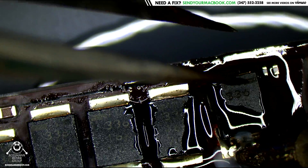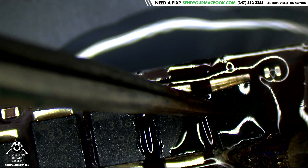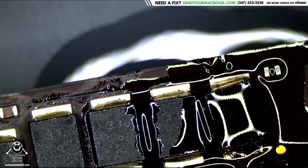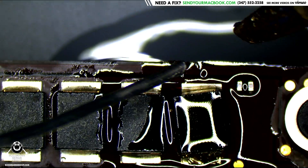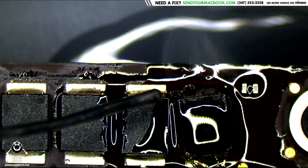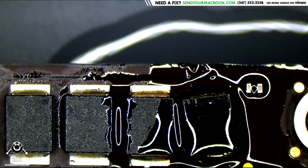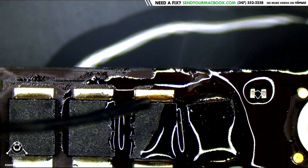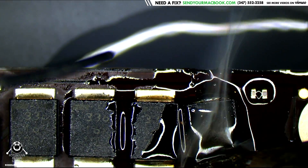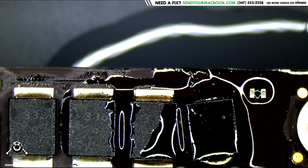Like Paul Wall would say — sitting sideways. And now we solder on the top. This side is going to be closer to flat against the board. This is how you could do it if you don't have a hot air station — something someone asked in the last AMA stream. You could buy a cap off Mouser and just solder it in like this. I did not use a hot air station to put this SMD component in.